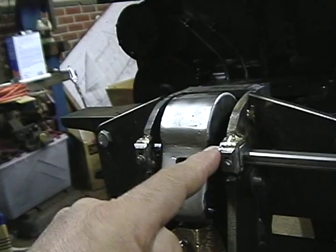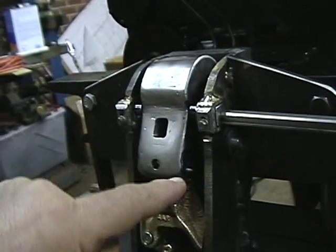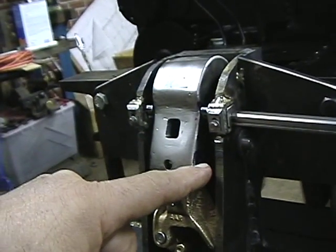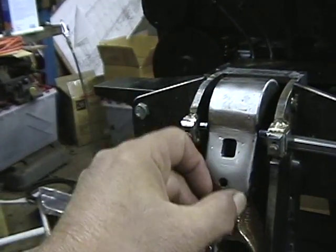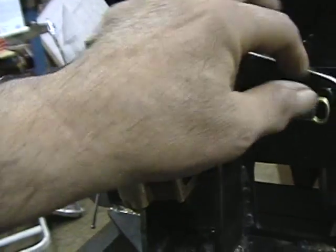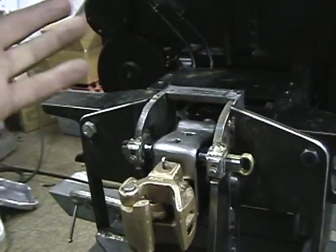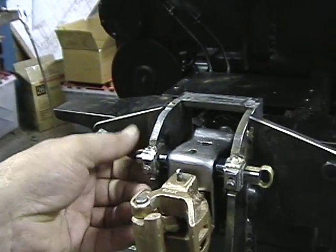The holes on the side here are square. What I did was take two quarter-inch steel plates, weld them together, machine them as one piece, and cut the square holes in them. Then I pivoted them around the pin on the rotary table — one was square with the hole at 90 degrees, and the second is at 14 degrees from the first, so I just rotated the rotary table 14 degrees and cut the square hole. The centerpiece is one-inch steel machined so the holes were hollow going through. On the prototype, the counterweight back part was actually hollow and could be filled with lead, sand, or dirt — but that's not needed on the model.